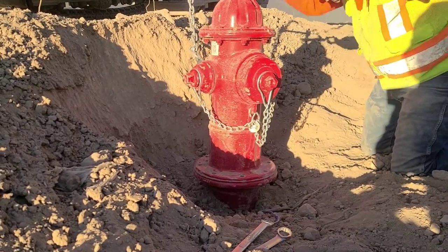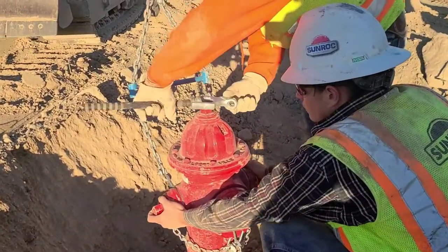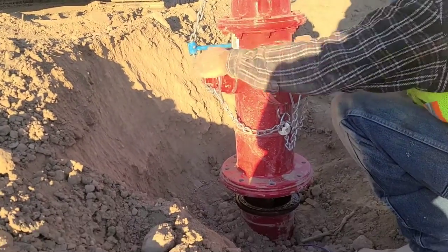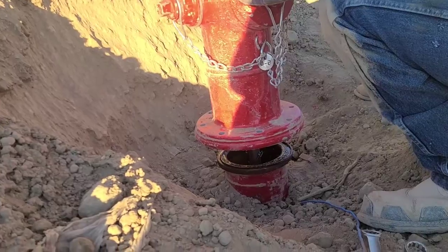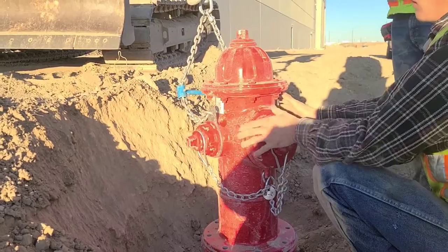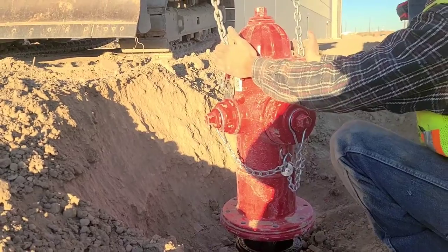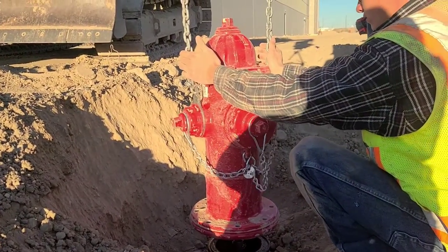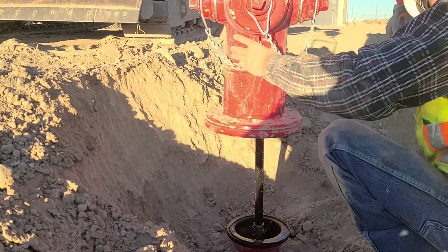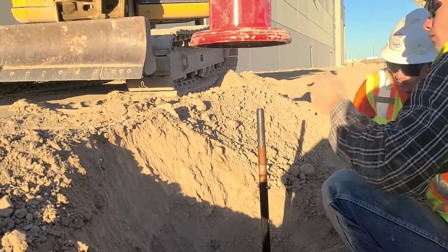As you can see, it's starting to lift. You may need another hand to hold the hydrant straight. Now that we have unspun it and we can see the bottom all the way off, we're going to lift that hydrant completely off. Try to do it as straight as possible so that you don't cause any kinks in the rod inside. Then just hold that in the air so that it doesn't get dirty on the bottom.